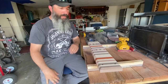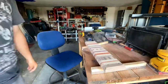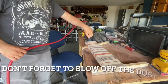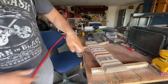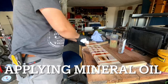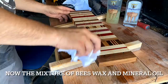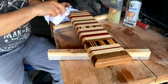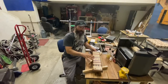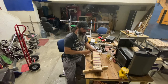Now it's pretty well dry so I'm going to re-sand it with 220 grit and get all these little burrs off the top and bottom of this board. Once I get it sanded down we'll go ahead and coat it with the mineral oil and beeswax mixture. I finally let it sit long enough to buff off that final mixture — I first used the mineral oil and then put the beeswax mineral oil mixture on here. I think it turned out pretty good.